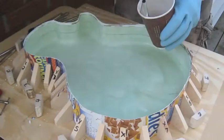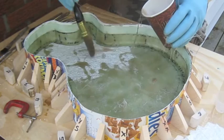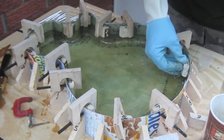Laying fiberglass can be a bit stressful and messy. Once you mix the resin with the hardener you have five to ten minutes working time, so preparing ahead as much as possible helps everything go smoothly. I pre-cut enough cloth to cover the entire mold with at least two layers of fiberglass — that should make the back strong enough but not too heavy.